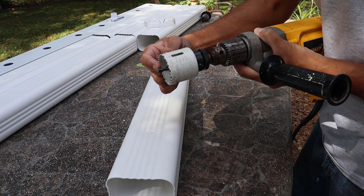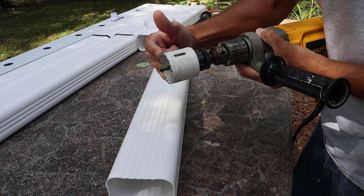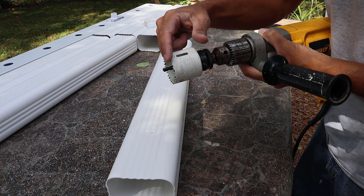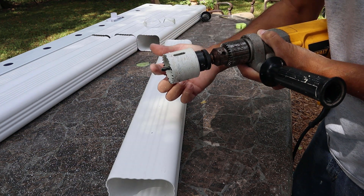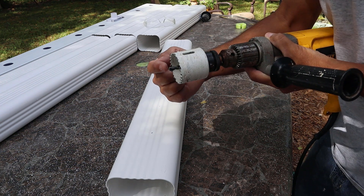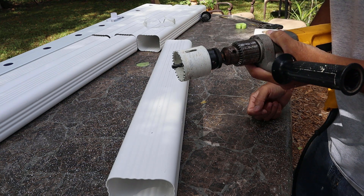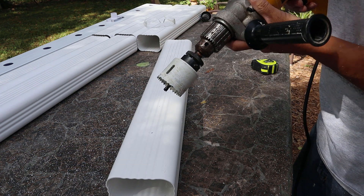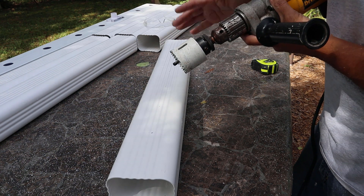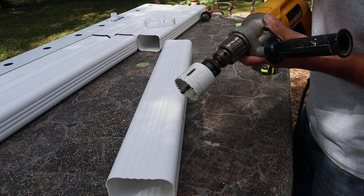...your pilot hole — you'll pop through there. When it pops through and pushes up against the plastic, it'll bite into that, and this might spin or twist your wrist. If you're going backwards it's nice and smooth and makes a smooth cut — it takes a little bit longer. Another thing you can do is drill your pilot holes everywhere first with the same size bit, so the holes are ready and you don't have that force when you land on it. So either drill backwards, or drill yourself a bunch of pilot holes — that's a tip from one of our viewers.